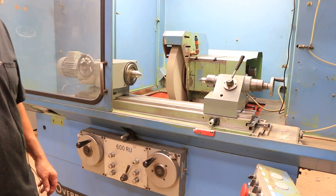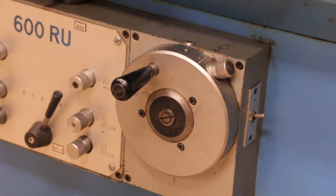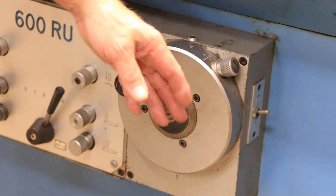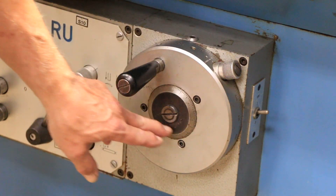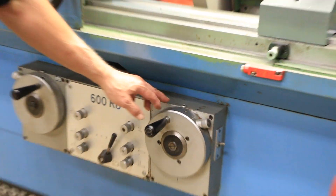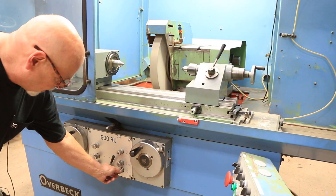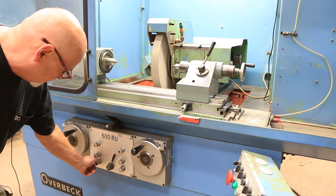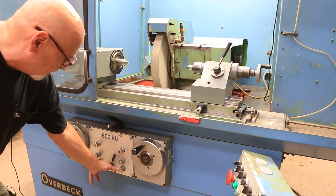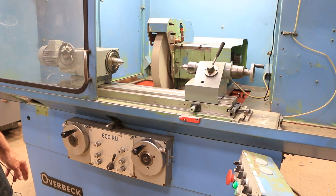Each time we reverse here we're incrementing. This also has a fine feed dial — if when you get down to zero the size is wrong, you make the adjustment here. You can see your adjustment on this center dial against the witness mark. The amount of increment is adjustable for your left and right sides, so you can decrease one side and increase the other, make them equal, or completely shut one side off so that you only feed on one side.